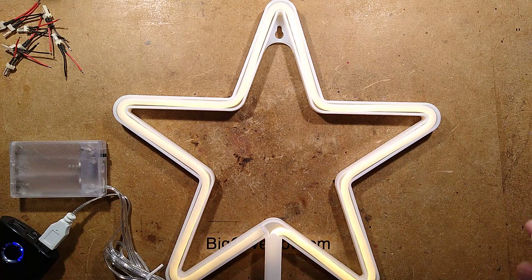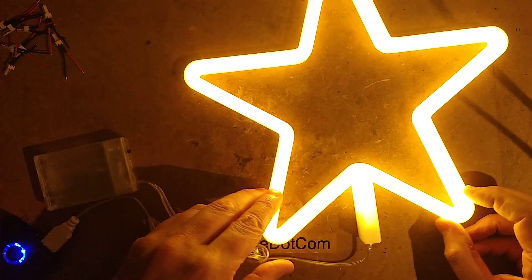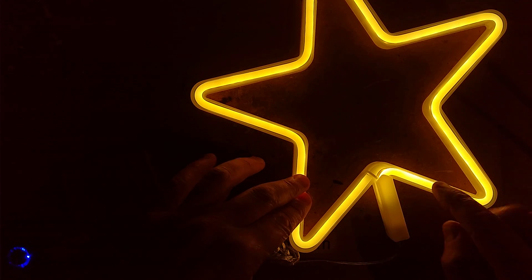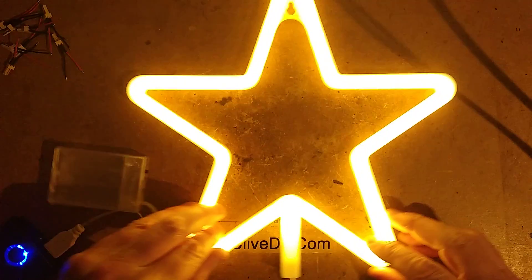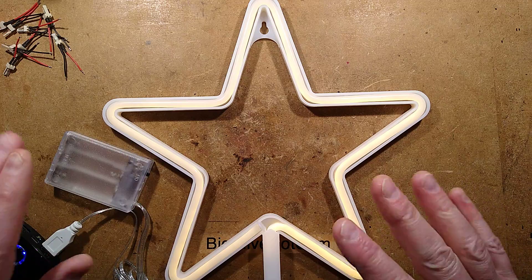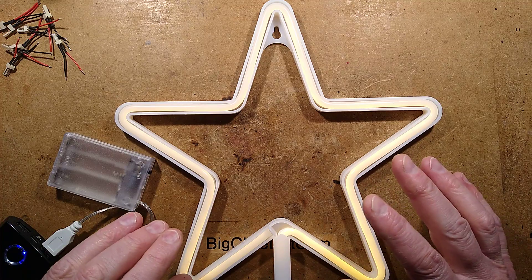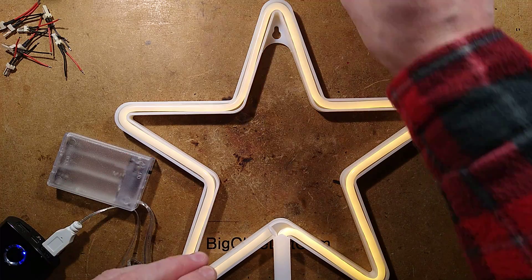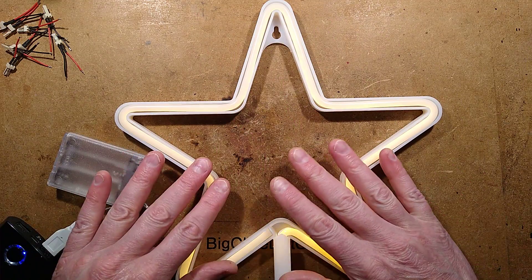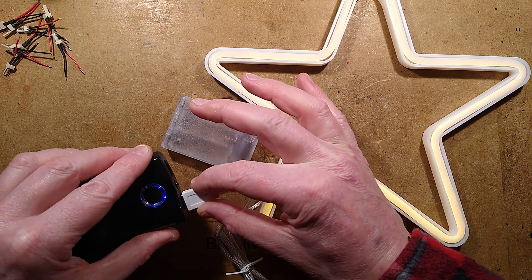You can see how it's a lot hotter here versus there, where the intensity tails off, because this is low voltage LED tape. When it swamps out it's not too bad, but I want to swap the existing low voltage LED rope for 12 volt stuff, just so it's compatible with the standard 12 volt supply running everything else. It also means it's going to have consistent intensity from one end to the other, be fairly bright, and have a very known current.